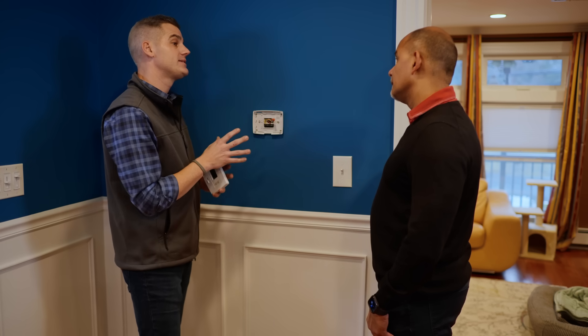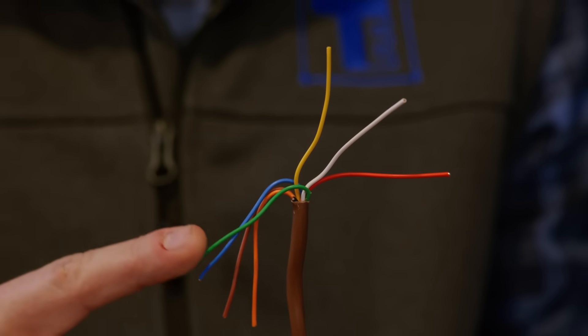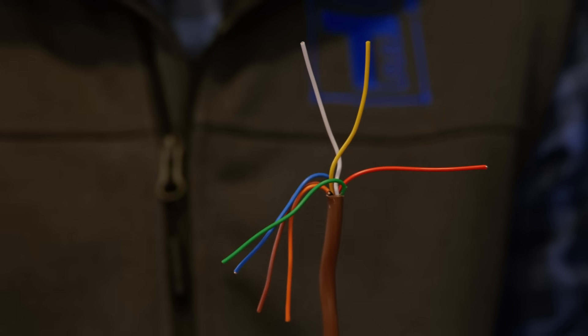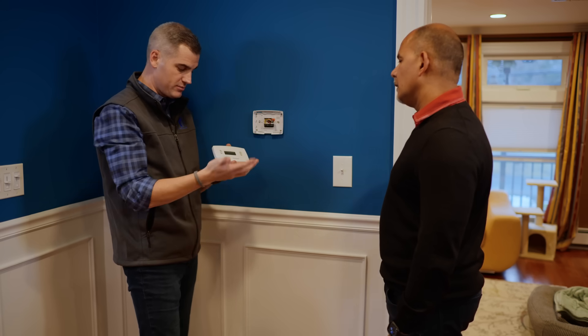The next solution is that we could repurpose the fan wire and make that the common wire. So you have a seven-conductor 18-gauge wire — the orange, brown, blue, and green do not make it past the splice, so those are not available to us. We have the 24-volt hot, the fan, and the cooling wire. My proposition is to move the white wire to a common wire, so I have 24 volts on the red and the common to power up the thermostat, and I run the cooling on the Y wire. The downside is that I'm going to lose independent fan control — so if you go fan auto versus on, I won't have that capability. Do you use the fan on switch? Never — we usually leave it at auto. So that would not be a big loss. All right, so that could be the best solution. I'm gonna go grab the thermostat.